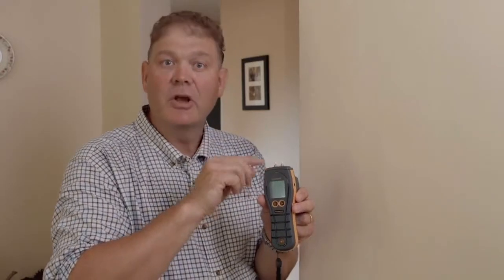So using a combination of both pins and non-invasive, we can determine whether the moisture is surface or deep throughout the wall. High readings on the pins with low readings on the non-invasive would indicate surface moisture.